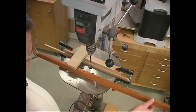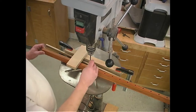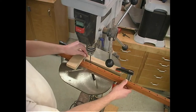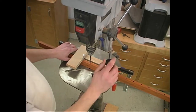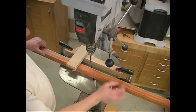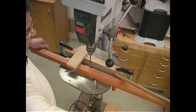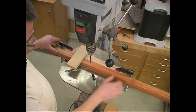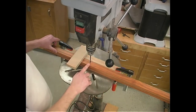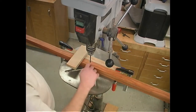The first hole must be very accurately drilled based on the layout dimension. Once that first hole is drilled, I drop in a ¼-inch diameter clevis pin as the index pin, bump it up against the stop, drill the next hole, and keep repeating all the way through. For the front legs, we don't want the holes 3⅛ inches from the edge but rather at the center, so we don't need the shim. I carefully line up the layout mark with the point of the brad point drill bit, drill the first hole, index the part down, and continue all the way along the length of the board.